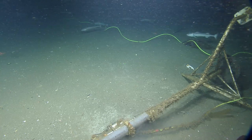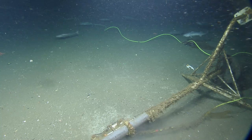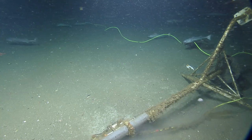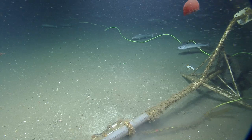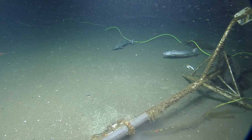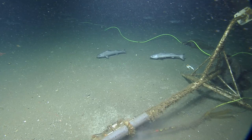So we can either fly it up by the instrument or we can tilt it up by the foot. The only thing I don't want on this back part of the CTD is where that's the intake to all of it. If that touches the mud, then we have a likelihood of plugging it. So I'm worried if we push on the leg, it's just going to keep sliding down. It might not happen, but that's the worry. So if we can, I'll fly it up.